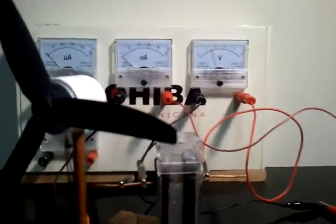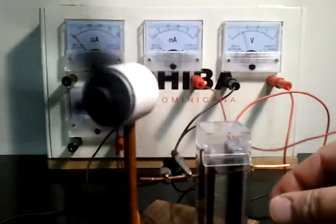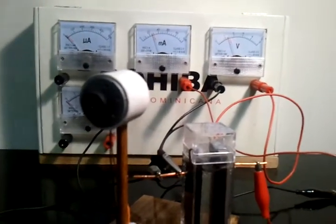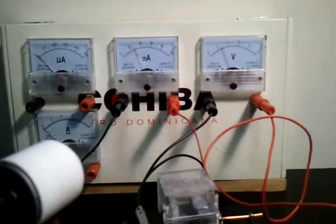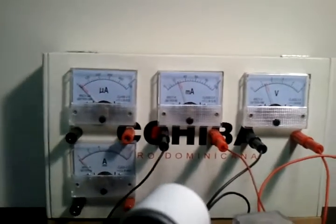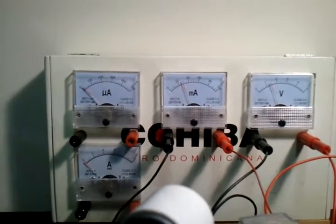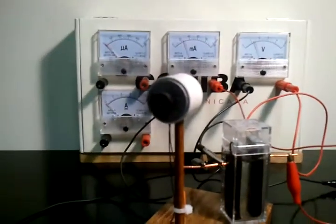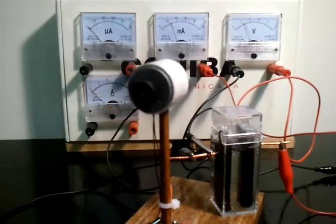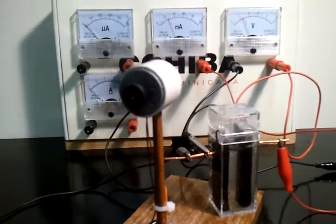Let's take a look at this and hook it up. There goes the fan. It's running about 1.4 volts, and on the milliamps it's just a little under 30 milliamps. It will run this motor for a good 5 minutes before it really starts to slow down, and that's with a 10-minute charge on that cell. So that's pretty neat.